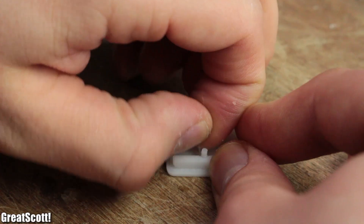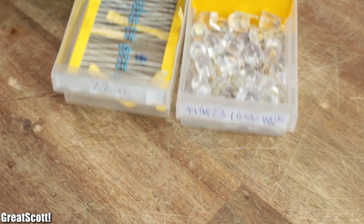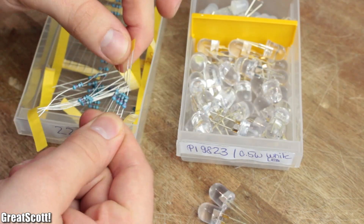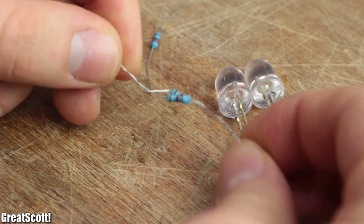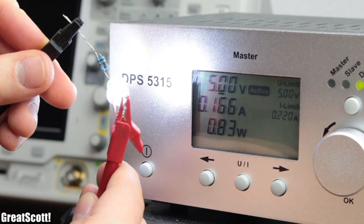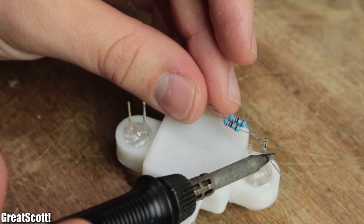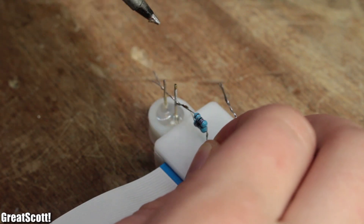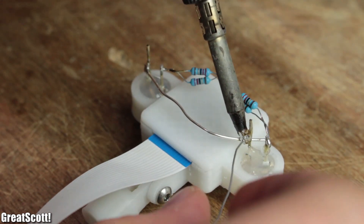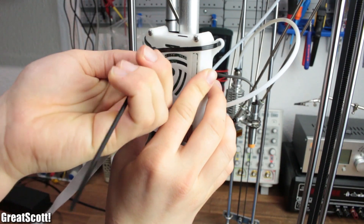After removing the plastic strings from those parts, I performed a successful test fit and continued by gathering two 0.5W white 10mm LEDs and four 22-ohm resistors. By putting two of them in parallel, they can be used to power one LED from a 5V power source. I used hot glue to secure both LEDs into place, soldered the two resistor pairs to the anode of the LEDs, soldered the other side together, used silver copper wire to connect the cathodes together, and finally added two more wires to this constellation.